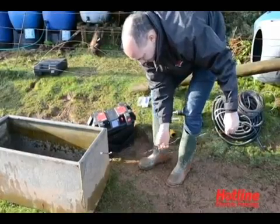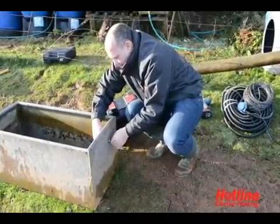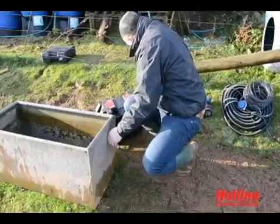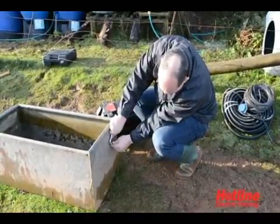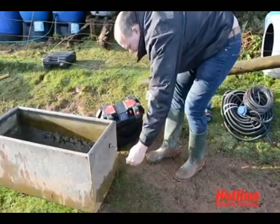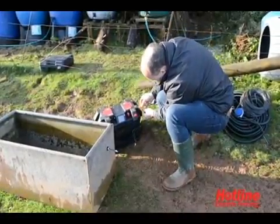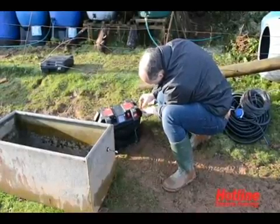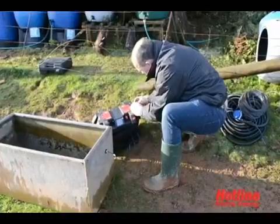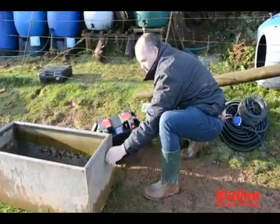Thread the nut back over the leads. Again, making sure internally the float switch is the right way up. Take it finger tight. Take your adjustable spanner and just nip it so it's nice and tight. On the end of the lead you have a red and blue connector tags going to the red and black terminals on the master box. That's the float switch nicely fitted.